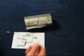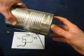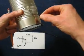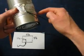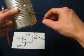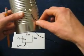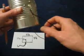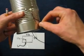So that's about it. That's how to build your own wireless Cantenna. Oh, one quick last thing I did not mention. Because of the strain on this cable, I put some tape around here so the cable wouldn't get flexed too much and damaged, because it's soldered here and you don't want to pull on it or change the length because it's pulling out. So put some packing tape or something here so it acts as a strain relief.